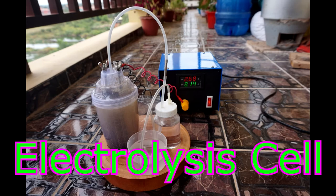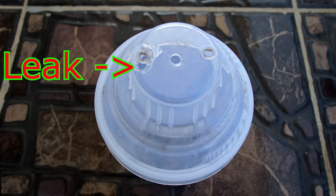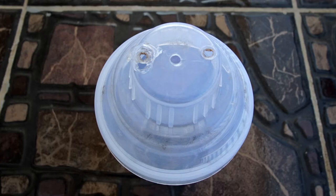I made this electrolysis cell two years ago and it worked very well. Recently I decided to use it again for teaching and refilled it with electrolyte because it had been stored dry for more than a year. I found I had a problem - there was corrosion. Although the plates are stainless steel, there was some electrolytic action which increased the internal resistance. One of the connections at the wingnut had oxidised, the increased resistance heated up the stainless steel wingnut and bolt and melted a hole in the plastic top, which made a leak. So I decided to build a new one, a bit more heavy duty.